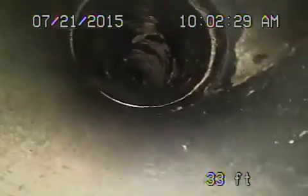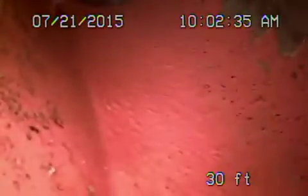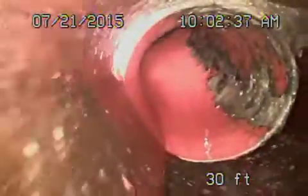That's clearly a crack in that pipe, but anyways that would be dug up. Then it would transition to clay, which the clay looks okay. Keep coming back and then we go to cast iron pipe. This is coming underneath the house. Cast iron also looks like it's okay — it's got a little bit of buildup but it's fine.